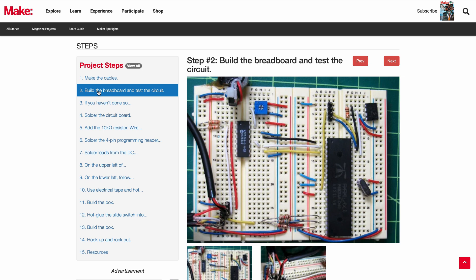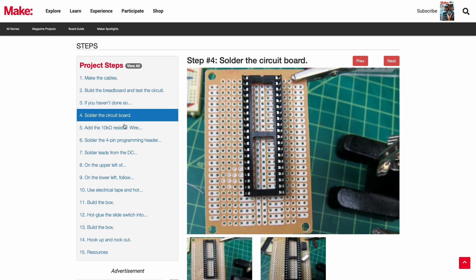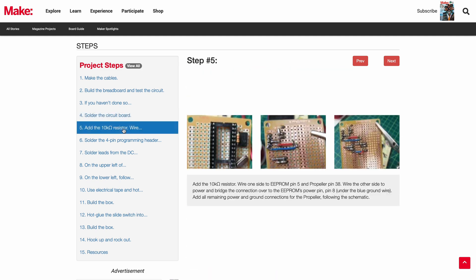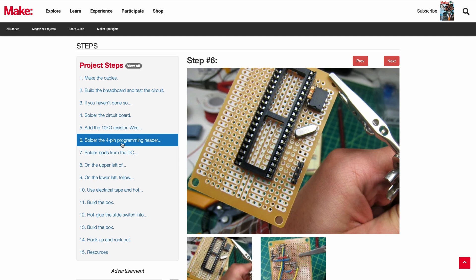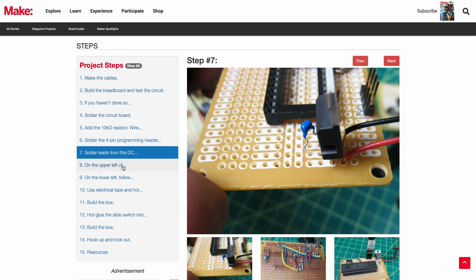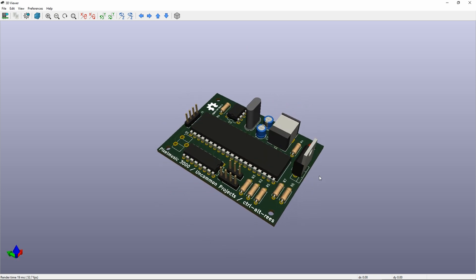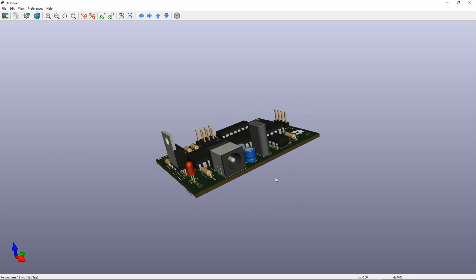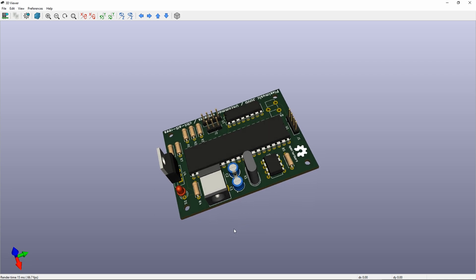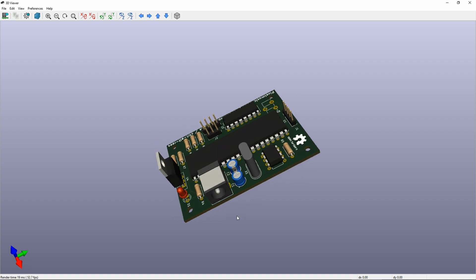The original project was built on perfboard, with a breadboard prototype of course, and built around the Parallax Propeller — an older but very capable 32-bit 8-core RISC microcontroller chip introduced in 2006. The Propeller supports programming in assembly, C and C++, and its own proprietary languages Blocklyprop and Spin, the latter of which was used for this project. On the hardware side, the Pixel Music 3000 uses a 24LC256 256k serial EEPROM to store the program code, and an MCP3208 analogue to digital converter to get the music into the thing, plus just a small handful of discrete components including a 5MHz crystal to clock everything.